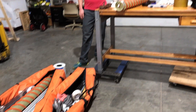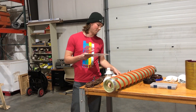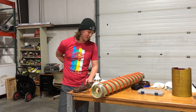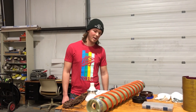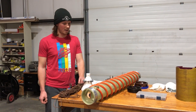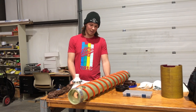Everything I discuss here is available in the hand auger manual, and you can download it from icedrill.org — that's a good reference. For your SIP requests, with the hand auger system you don't need to request a whole lot. I recommend requesting glycol for any recovery issues, say if you get the hand auger stuck down a hole. We are now transitioning to glycol because ethanol has been interfering with our flights. I'd also recommend getting a shovel in case you need to do any site prep to remove loose snow so it's not falling down a hole on top of the hand auger.